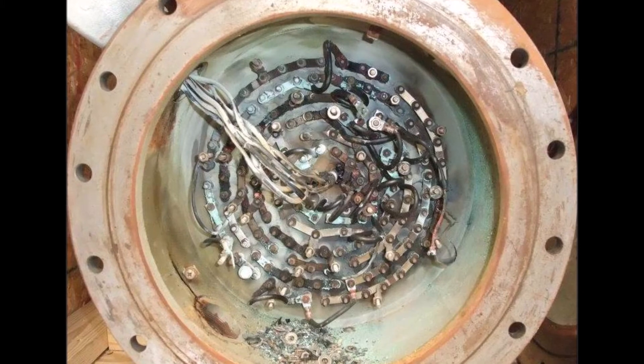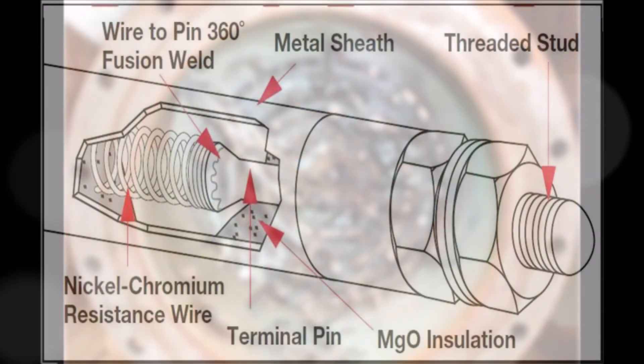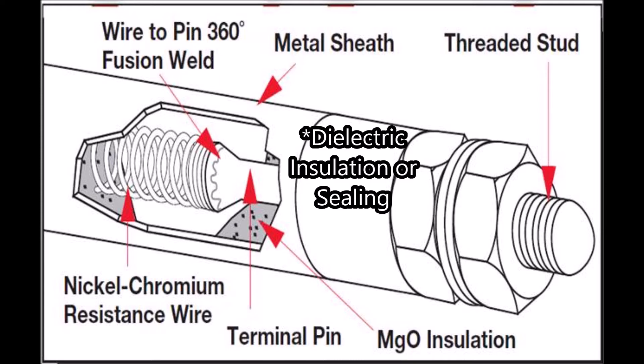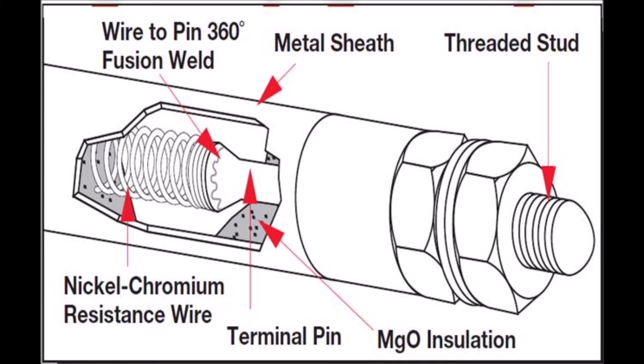You can see the inside of a heater element — the nichrome wire is spiraled around, and this is what provides heat into the element. Prior to that, there's a cold pin that goes all the way out of the element where it's tied to the bus bar. It's very important to have good insulation so that moisture doesn't ingress into the compressed magnesium oxide, as this will weaken and reduce the life of your heater element. The mega test shows you how much moisture is in this area — you always want a dry heater bundle before you apply power.